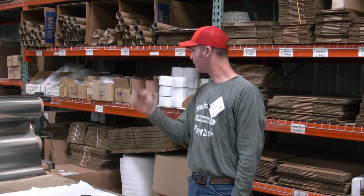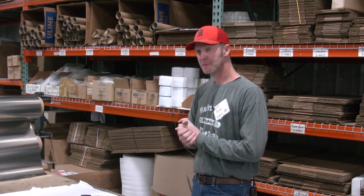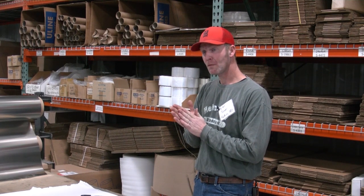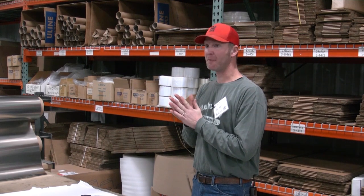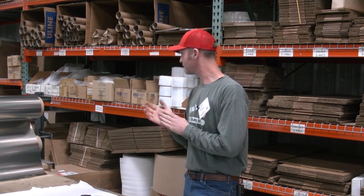You think it'd look like, man, I ain't got nothing left there for the lock bar to go over. A carbonized lock bar isn't going to wear like a raw lock bar, unbaked, uncooked, uncarbonized. Is that going to wear? Yeah. So titanium absolutely will wear out quick. Oh, extremely. It will gall and smear. You can watch it.